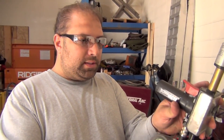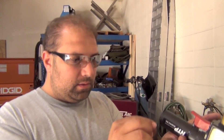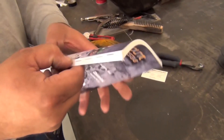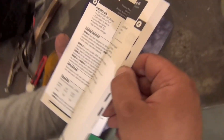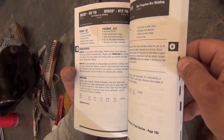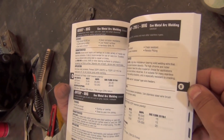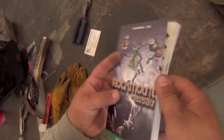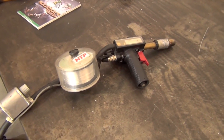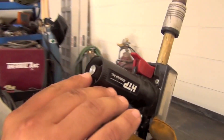As far as voltage and wire feed, we can refer to books for those parameters — we've covered this in a video or two before. With the wire size, they give you wire speeds, voltages, and amperage ratings. We want to be at roughly 21 to 23 volts, and we'll dial the wire speed to match on the gun. The wire speed adjustment on the gun is here on the bottom, and the voltage we're adjusting right here.